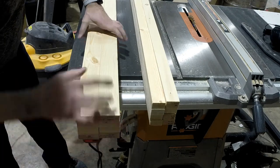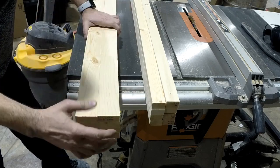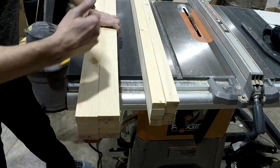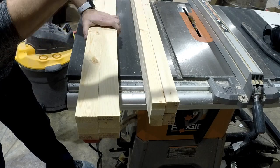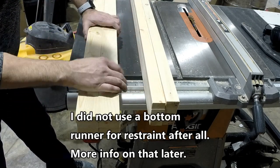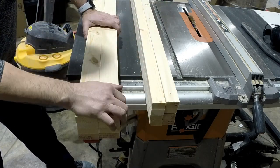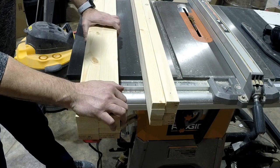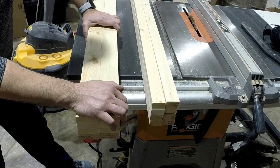These are going to become the perimeter of the baby gate. I have kind of a little drawing: it's basically going to have casters on each end, a J-hook to keep it stable at the top, and a steel runner down the center of the baby gate. The casters will be inset on each end. I'm going to use four-inch casters with polyurethane - they roll really nicely and they're going to be big and robust. It's going to look cool.